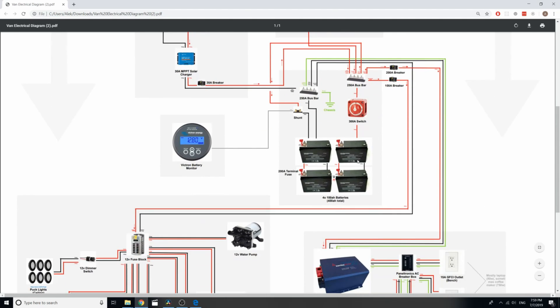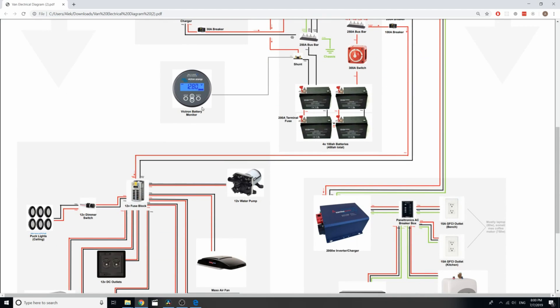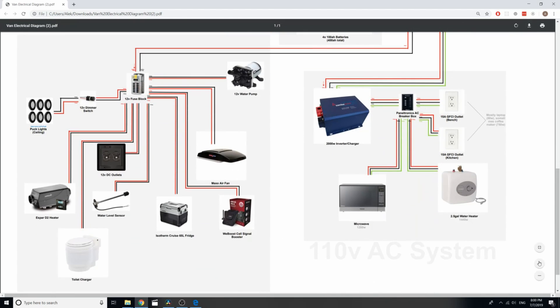The battery system itself has 400 amp hour batteries, all fused on the positive terminals. There's a switch coming directly from the batteries onto the bus bars, preventing all current from flowing if I turn it to the off position. I have a Victron battery monitor, which connects to the negative side of the shunt. On one side of the system I have my 12 volt fuse block with all my 12 volt accessories, and on the other side I have my 120 volt AC system with a 2000 watt inverter charger, a Victron AC breaker box, and all of my AC peripherals. Alright, enough with the boring stuff — let's get into the fun part, the installation.